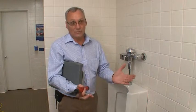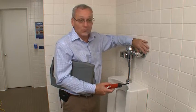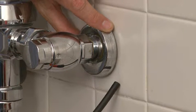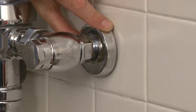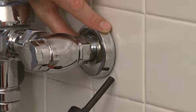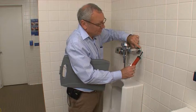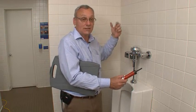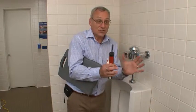We're in a typical washroom area with a plumbing stack behind the wall. Plumbers love to make large holes and cover them with escutcheons — and you'll notice escutcheons are getting larger and larger. Pulling this back and puffing smoke, you can see it being pulled right into the shaft behind — it'll switch back and forth depending on pressures since we're in the center of the building's height. In a bathroom like this we have three plumbing stacks, another three for toilets, and three per sink for three sinks — that's 15 holes leading into a shaft behind the wall, plus the paper towel holder which is an insert that's part of a stack behind it.